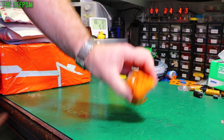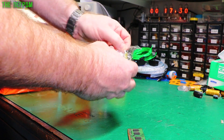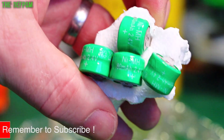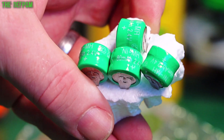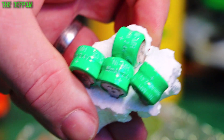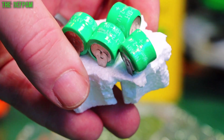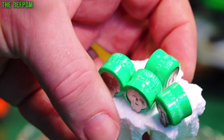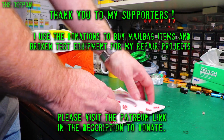Small package and lots of tape. I purchased these because of a recent repair I did. Four batteries - nickel metal hydride, 80 milliamp hours, 2.4 volt. I don't actually have anything like this so I thought I'd buy some, because you never quite know when you're going to need them. Being rechargeable you can just leave them sitting around for a while - charge them up once in a while and they'll sit there just fine for years.